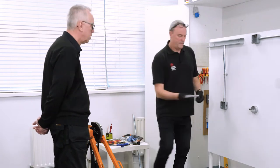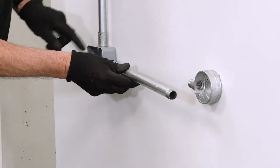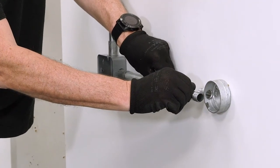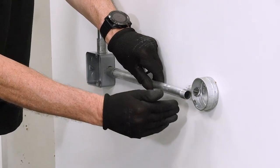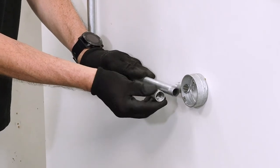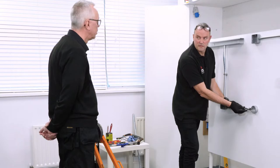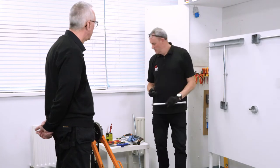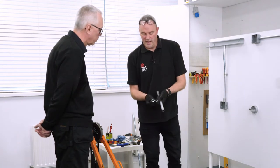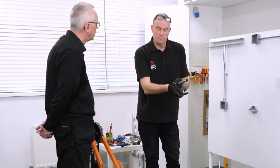What we will actually be doing is measuring a length from the box to just before the end of the nipple, then cutting it there. I will then thread this the full length of a coupling, plus two more threads. The reason why we have two more threads is that we use a lock nut or a lock ring. You use this to lock off and stop the coupling coming undone.